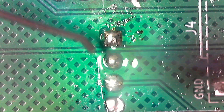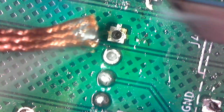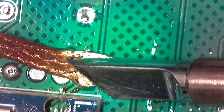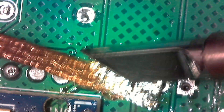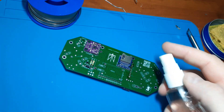To make things easier, you can mix the unknown solder with quality solder — this will lower the melting point. Add flux and clean the pads using the solder wick. Work carefully with the wick — it loves to solder itself to the copper and cool down, so it's very important not to pull hard on it or you'll tear off even more pads from the board. Wick that has absorbed a lot of solder should be cut off with wire cutters to keep working with a clean section. Carefully heat it and draw it along, absorbing solder from the board. If it keeps sticking, you can raise the iron temperature by about 20°C at this stage. Flux that has already been heated by the iron loses its properties and may start to burn, dry out and contaminate the board, so it's better to remove it regularly. While it's still hot, you can do this even with a dry cotton swab. If it's already hardened, wash it off with alcohol.